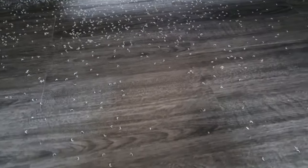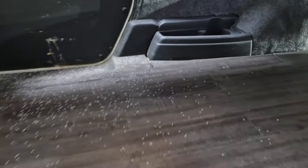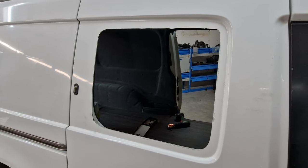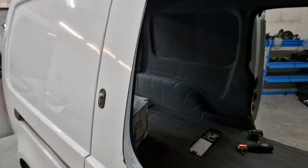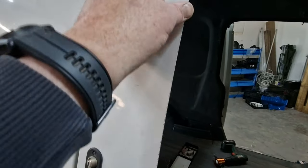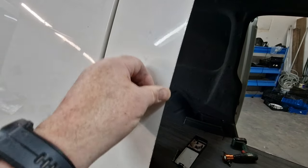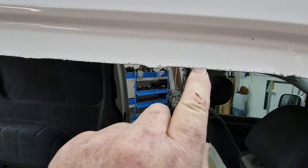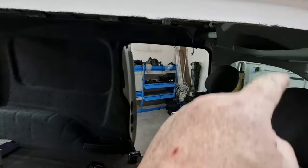What I do next is get rid of all of these little chippings the nibbler takes out — they hurt like hell when you step on them, they go through your shoes and socks. Going around to that side, you can see it gives a really clean edge; you can pretty much run your finger down it. What I do there is tidy it up with a file — I changed the battery on the drill so just file that little edge off.